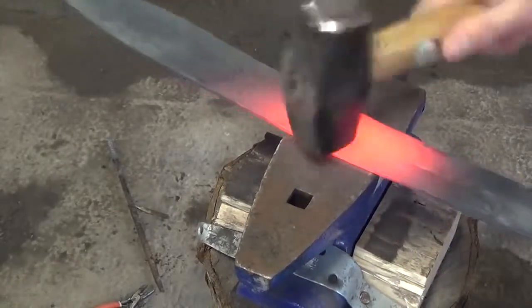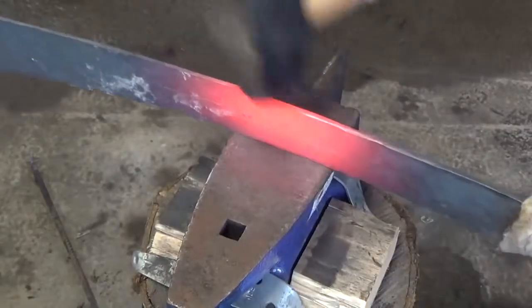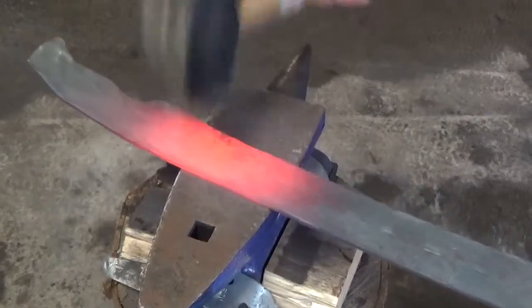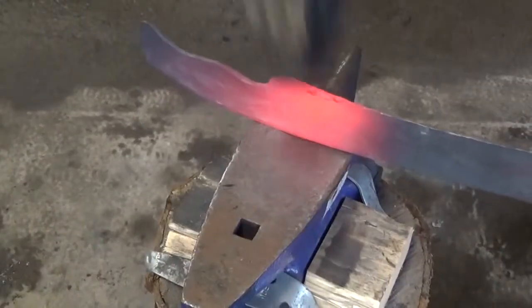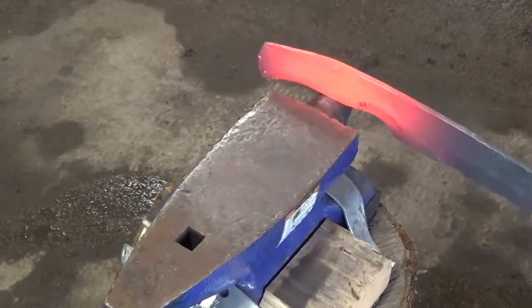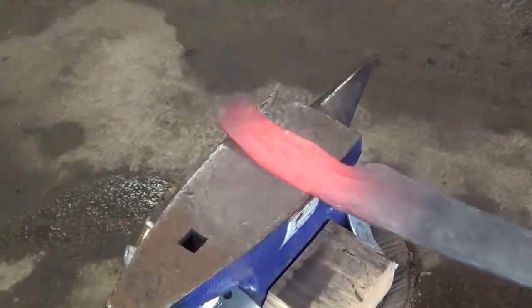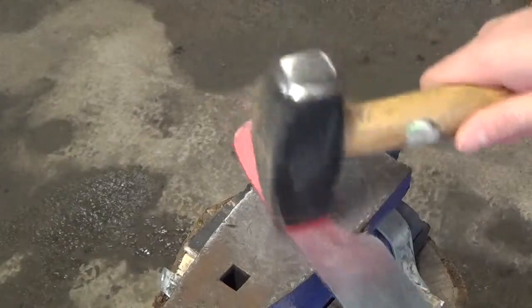The thicker areas where there aren't any holes in the blade need to be drawn out a little bit more and any excess material is being drawn to the edge. Once I've got everything cleaned up and flattened out the way I want to I start working on the handle. I use the horn of the anvil to give myself nice curves so that I don't have to do any grinding to finish up the handle. I'm just hammering here and there trying to get everything nice, aiming for a smooth finish and a nice smooth taper.